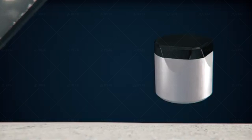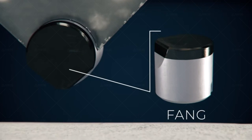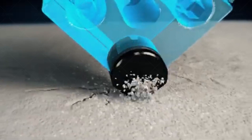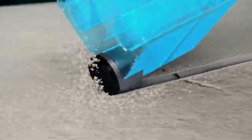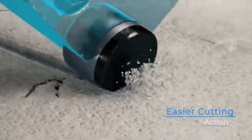If that doesn't do it, rapidly stroke the pipe up and down the derrick, but don't hit bottom. Free falling pipe is a lot easier on a rotary table rig than a hydraulic top head rig, but it will help. You should be able to get thousands of feet of hole out of a good PDC bit. They are more expensive to buy, but the cost per foot is great. They can also usually be rebuilt. Good luck and keep them turning to the right.